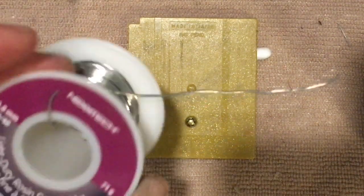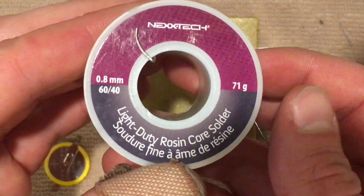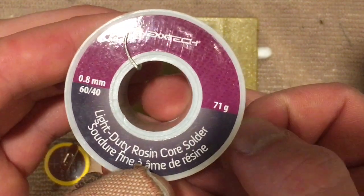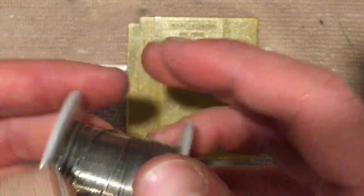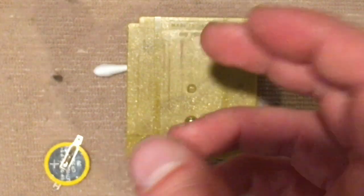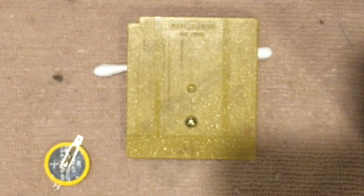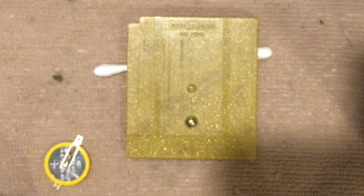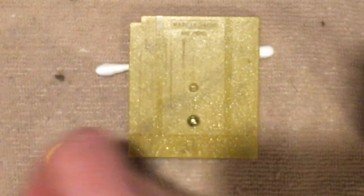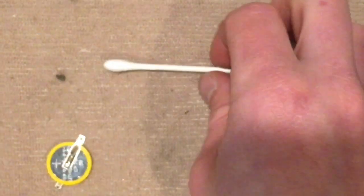As well as that, you may need a little bit of solder. This solder is 0.8 millimeters, it's a 60-40 lead-tin ratio. It's fairly cheap — I bought this for maybe under $10 Canadian, and there's a ton of solder in here so it's going to last a long time. Lastly, you will need a soldering iron. There are ways of replacing the battery without actually soldering, but I really don't like those as it involves taping the battery. Anyone who's ever used tape will tell you that tape isn't a great solution — tape loses its connection, it falls, it gets sticky. Why not do it properly? It doesn't take very long and it's really not that hard.